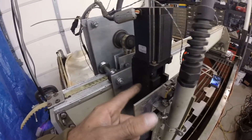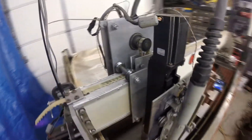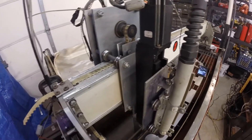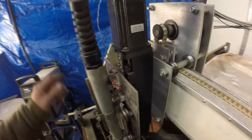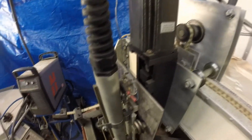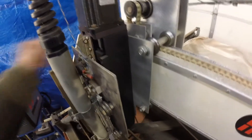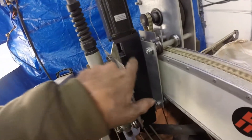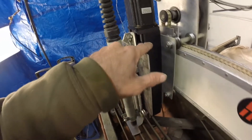This linear rail for the Z-axis I also bought on eBay — it was surplus. You don't have to do it this way. When I built this, a lot of these cheap CNC parts that exist today did not exist then. With cheap 3D printers and 3D printer kits, now you can buy good linear screws and good rails. You could actually make something with a couple of straight rods, rails, and some rail bearings. This setup actually cost me quite a bit even used — close to 100 dollars. You can probably get this done for about 15 dollars today.